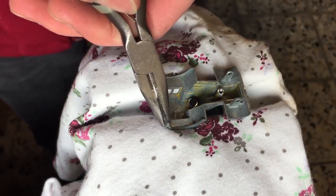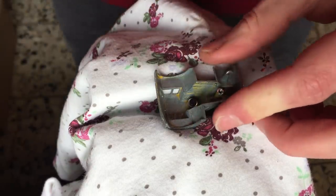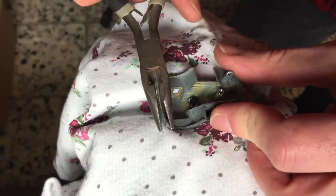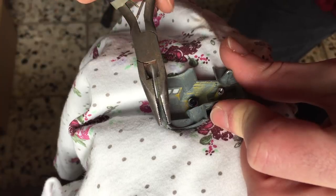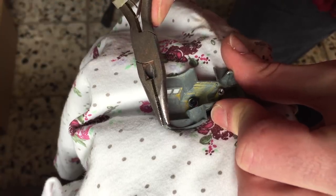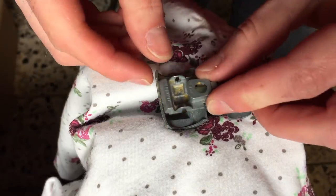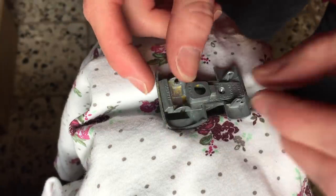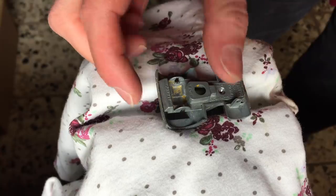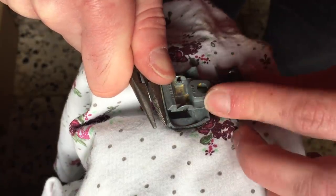As you might have seen, the front of the casting is bent inwards. I try to carefully bend it back into shape with some small pliers. I don't use a lot of force on the pliers so it doesn't create any indents in the casting. You can also see I test fitted the crane back onto the body using a screw and two small washers. I always check if the base plate still fits the body after bending the casting, so that I don't run into any problems later on. This seems to fit perfectly.